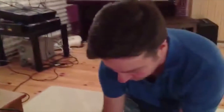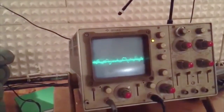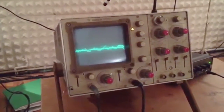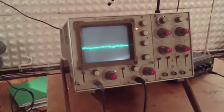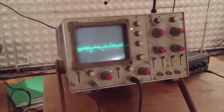Let's try that same thing again now with a light lead. We're going to plug in a light lead and show you the signal from it. Then we're going to plug in this 10k resistor as if we plugged it straight into a desk. The signal is exactly the same as it was. I'll unplug the 10k resistor — this is without the resistor — and then put it on — that's with. That's without, that's with. You can see there is absolutely no difference in the output from a light lead.